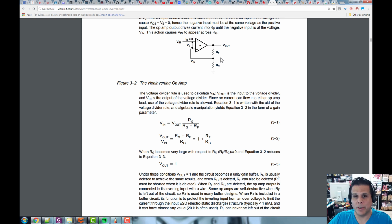But the moment we put 0.2 volts in, that would be 20 volts out, it's still going to stay at 10 volts. It's not going to generate some miraculous voltage. So again, the op-amp will only operate within the realms of reality, but it will attempt to be ideal. It will attempt to do these things, all right? It's never going to generate more voltage than you give it for the power supply rails, which we're going to see where you hook that up.